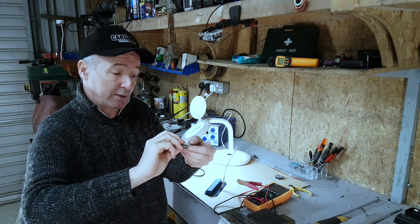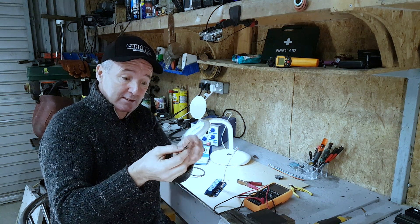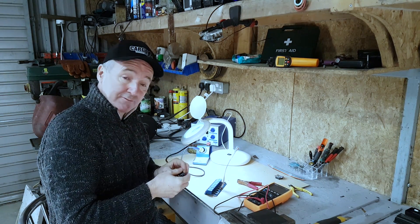So that's what I've done — I've soldered the pins on instead of using the little sockets. There's our D1 Mini board — it's a nice little board, it's got Wi-Fi built in. It's going to get powered off a mini USB connector and then it's going to use that power to fire up this relay.